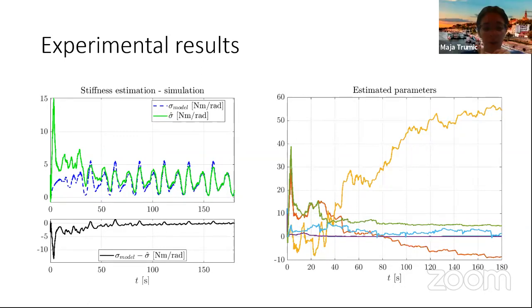Yes, actually, if you look at the unknown input observer, we notice that the delay we need to introduce in order to avoid using a velocity sensor is only 2 samples. So it is pretty fast. But the main issue, the slowest part in this chain, is the RLS algorithm. Due to the RLS algorithm, we have to wait 100-200 seconds until it converges properly.